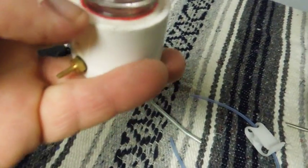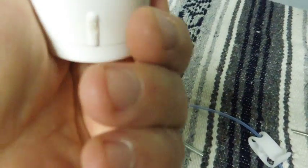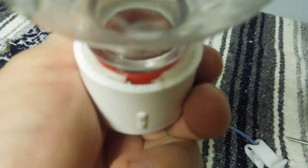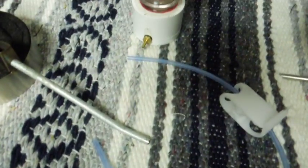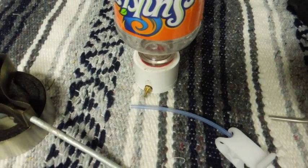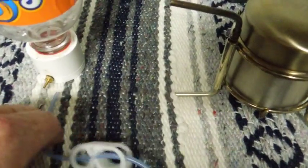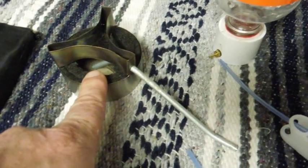There are two PVC fittings inside of each other. The inside one is grooved so that it goes down to the base. There's a bottle cap glued to the inside of that fitting. It works the same way as a turkey waterer or an office water cooler — it'll seek its own level. The level of this nipple will be the same level as the fuel inside your stove. It works pretty slick.